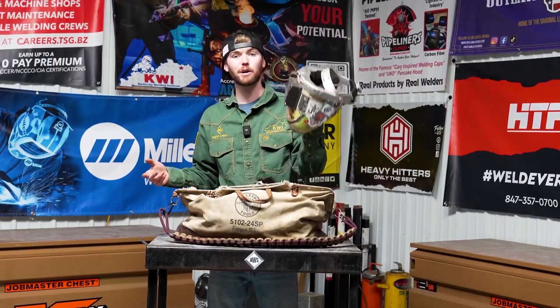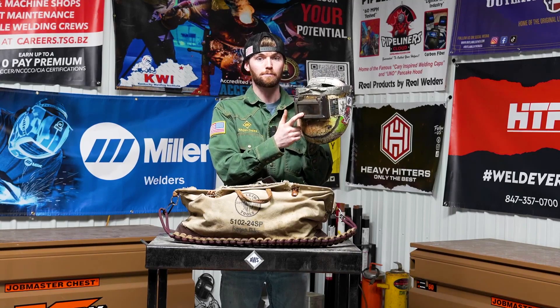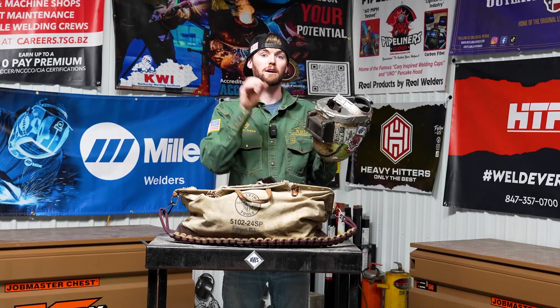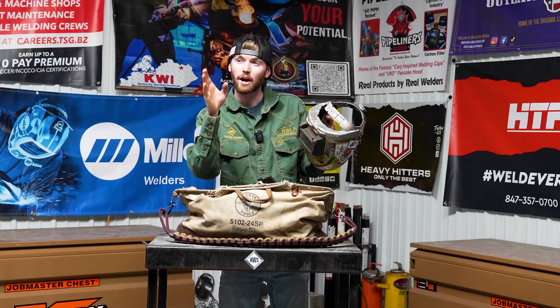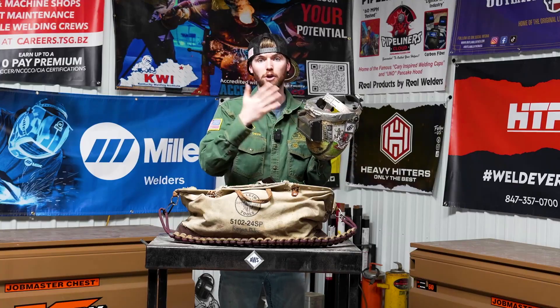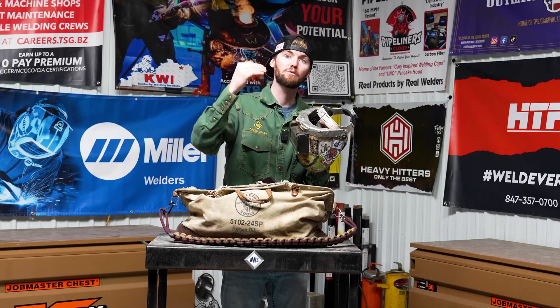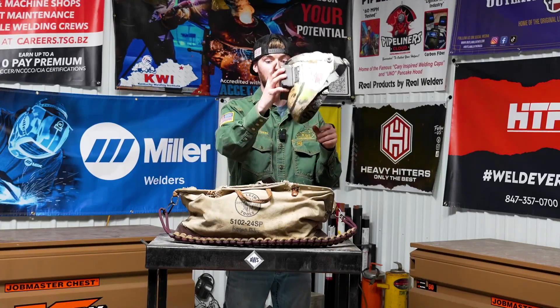The first thing is obviously your welding hood. Any welding hood will work. More specifically, I use a completely dark welding lens. I do not use an auto-darkening lens because whenever you're making certain welds or looking through the bevel, those auto-darkening lenses are going to flash on you. If you're out in the open, I love an auto-darkening lens. But if you're making field welds up in the rack, in the boiler, in a tight space, these straight dark welding lenses are great. The one I use is off Amazon — it's a $9 glass gold lens, shade 11.